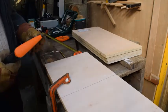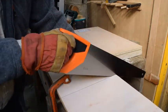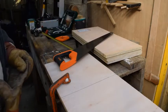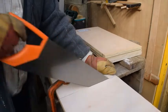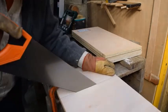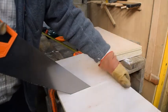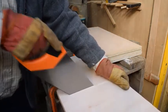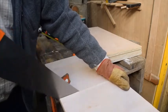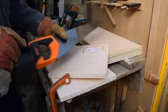So I've turned the clamp upside down, tightened it up nice and tight, and then we're going to pull that through. If you put your gloved hand against the line like that, and use your gloved hand as a guide, you can get started and just follow the line — blow the sawdust out of the way so you can see your line. As we get near the end, make sure the clamp isn't in the way of the saw, and if you can hold the two pieces together with your fingers while sawing through — keep the saw down, then hold and finally cut through. You can hold the pieces of wood together and that will stop them dropping on the floor. It's come off quite clean.